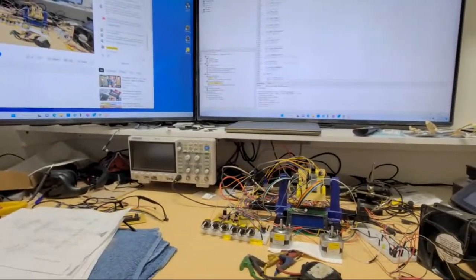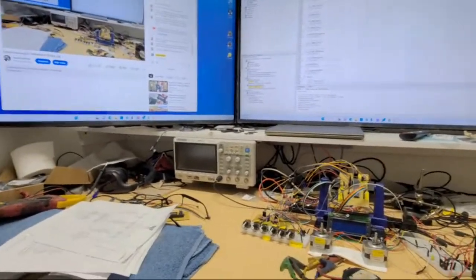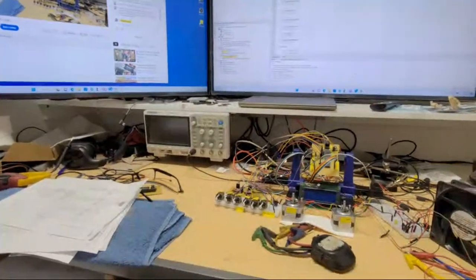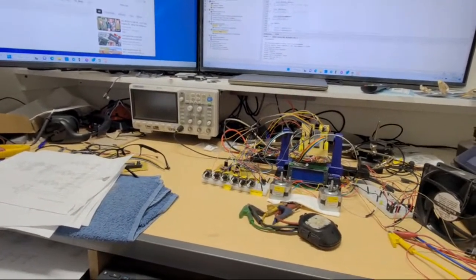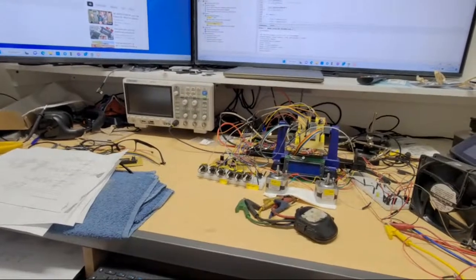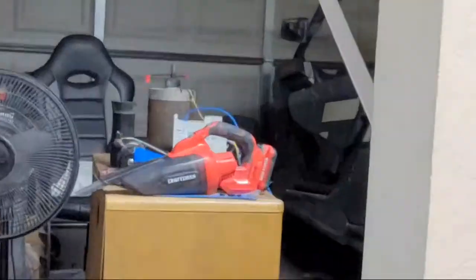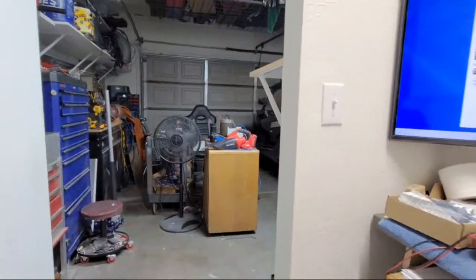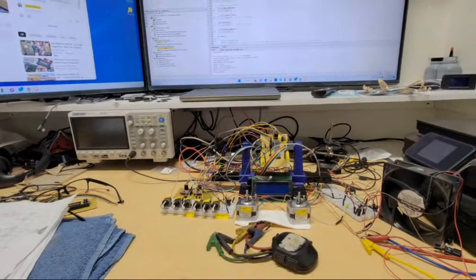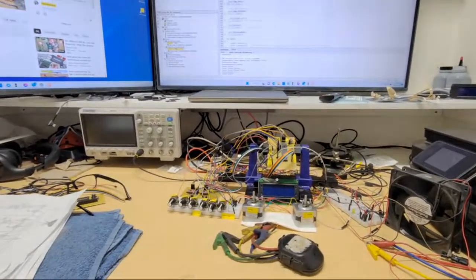It's got to be, man, because when that thing's going slow, and you look at a 1700 RPM fan motor, you can almost see the revolutions with your eye. So I guarantee that axial fan's got to be multiples higher than that. It's got to be up there. We'll find out. But you definitely saw that three-phase motor out there. I set it from 60 hertz to 240, which is 4 times its speed. It didn't get to 240. It starts screwing up about 200, but you heard how it is when you drop it down to 60. It sounds like it's crawling.